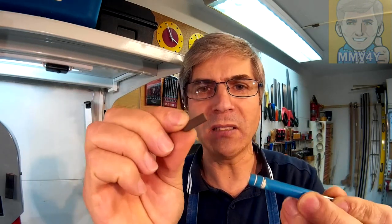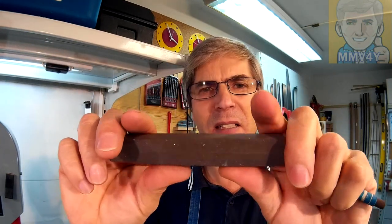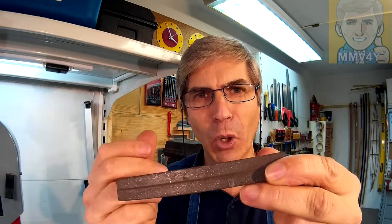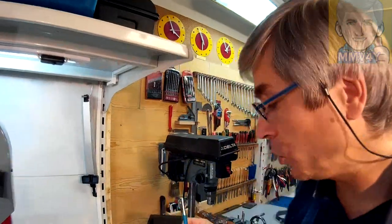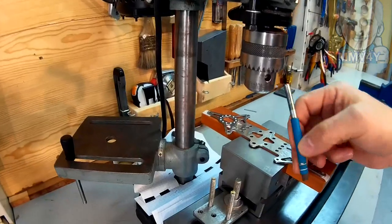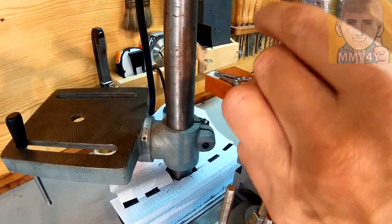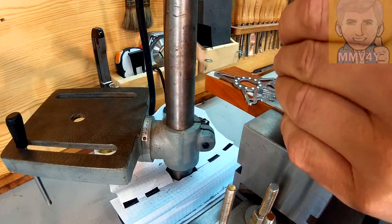And to make the jewels, I'll use this simple tool. It's just a plastic tube, it's actually from an old pen, and this is a drill. And this is actually what makes the jewels. It's a piece of abrasive rod that I cut off from this bigger stick. And this is actually rubberized, but it has some diamond dust and abrasive compounds mixed in with it. And now with this, I'll use this on my drill press machine. I just have to clip this.